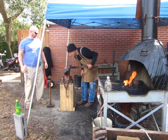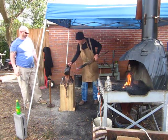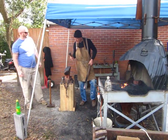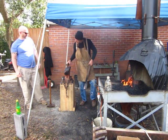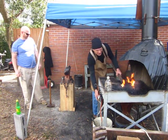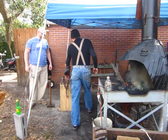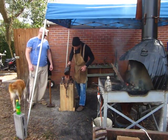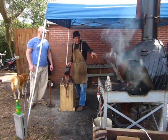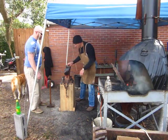Definitely tell a difference when I hit that than when I hit that. Because that absorbs a lot more of the shock than that. It's cold. They say that. Yeah, and that's neat. I don't know that experience because I've never done the sledgehammer part. But this is just a flatter. So what I want us to do is just flatten this piece of steel square to take some of this ugly charring out of it, and then we'll taper the edge down.